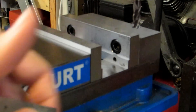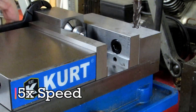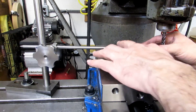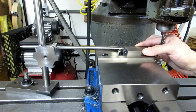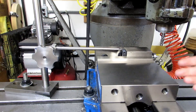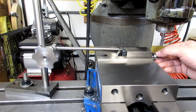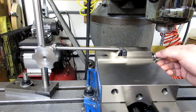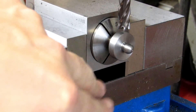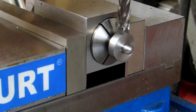I'm going to tighten that up as much as I can by hand and then put it in the vise and use the spanner on the back side — you want that good and tight. I've set up a table stop here so I can bump my collet block right up against it and get it in the same spot each time. It's not strictly necessary for cutting the flats since your cutter is wider than the piece, but I do have two cross holes to drill through the middle and I don't want to find the edge for each operation. I've got my collet block on half-inch parallels for more contact and to keep the table stop accessible.